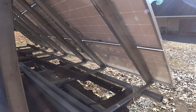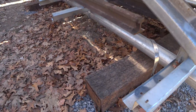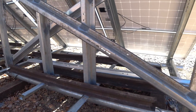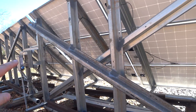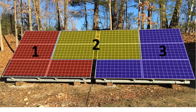This galvanized Z channel is actually a reclaimed product that I pulled out of a field. Everything is sitting on some used railroad ties which form the foundation. This does not go in the ground, so the whole system is ballasted with a little over 3,000 pounds worth of weight on the base. I added some diagonal bracing to keep everything from racking.